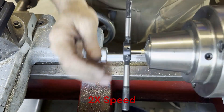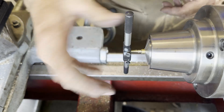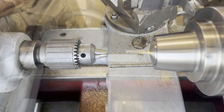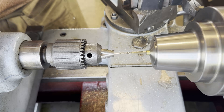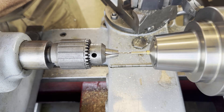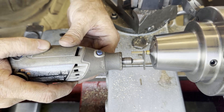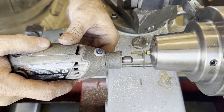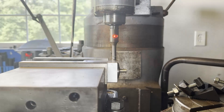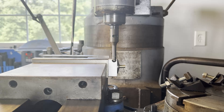I'm threading this by hand now — speeding it up so you don't have to spend a lot of time watching. I didn't need to thread it all the way up; I have plenty of length. I made a Sharpie mark, then center-drilled it and came through with a number 47 all the way through — that's 0.750 in depth. The only way to cut this off is with a Dremel; you can't part it off because it'll bend the brass at that point — there's not much strength to work with. You wind up with your stem, and you can see the little center hole is a little bit off — those small drills just wander on you.